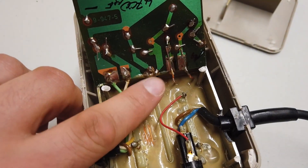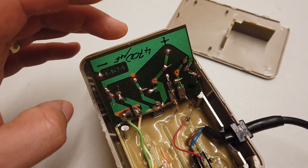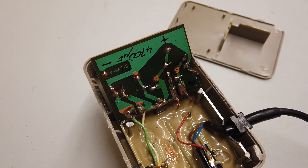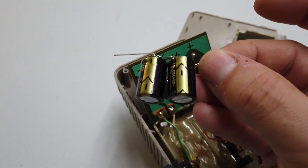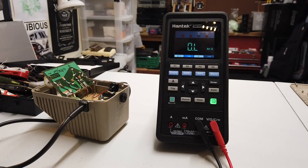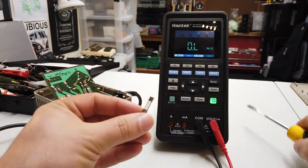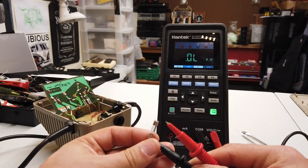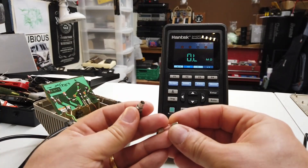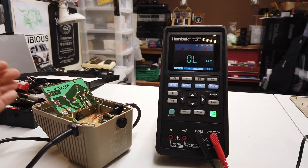I'm going to be careful here because the semiconductor is potted into resin. The first thing I did was scribble down the capacitor value, because ultimately it's the capacitor we're going to need to replace. Before replacing it we'll do a quick test with an oscilloscope to see what the output looks like. I also found a couple of low ESR capacitors to put in parallel to make up a value close to 4700 microfarads. One thing I'd forgotten was to check the fuse — make sure this is unplugged first since the fuse is on the mains side. The multimeter says the fuse looks good with no corrosion. We'll get that back in the fuse holder and then turn on the power supply to look at the output waveforms.